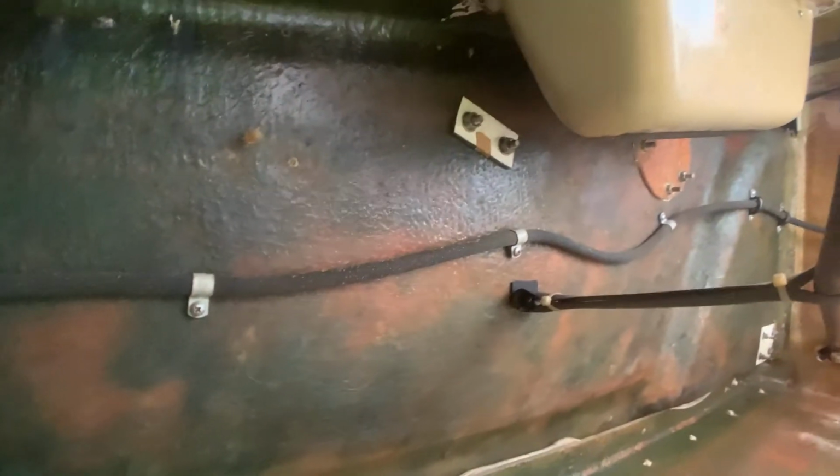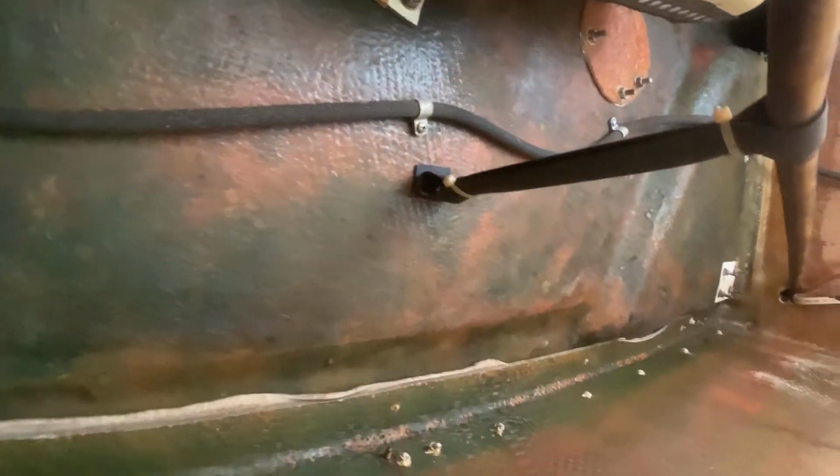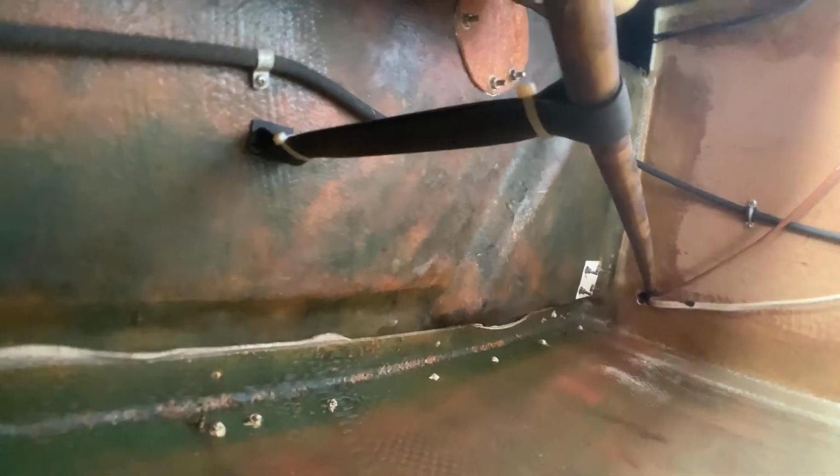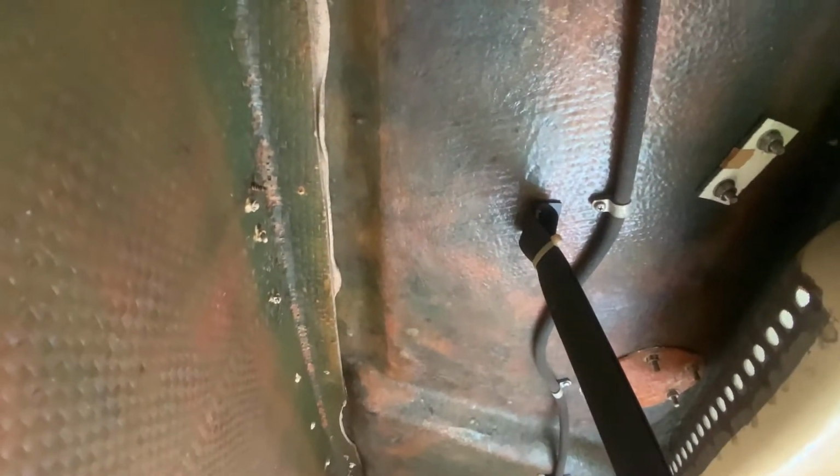And then, you know, you have the rest of the backing plates. Everything on this boat actually was done really well. There's backing plates for all the stanchions, and, you know, any of the cleats. Everything has a backing plate. So Pearson did it right when they did that. So let me show you a little bit what that looks like under the V-berth.